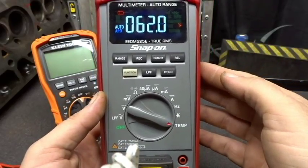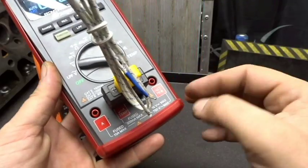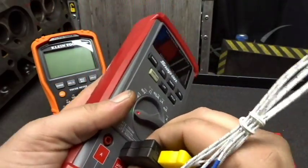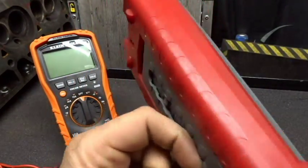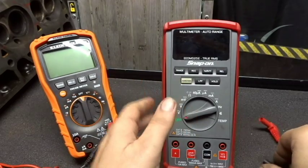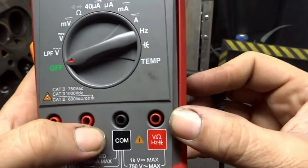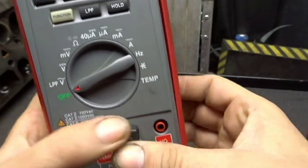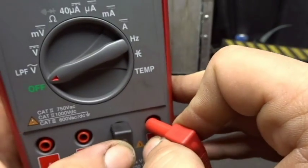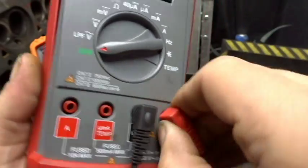You'll see it's picking up about sixty-one to sixty-two degrees in the garage, and that's coming from this little end here on the end of the probe. So that would be how the temperature setting works. Now let's get into how to test your test leads to see if you have an issue, because sometimes things can jump around. The most two common ports you're going to be using on this DVOM are the common ground, which is where your black test lead often goes, and the voltage or ohm setting over here.